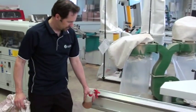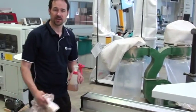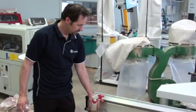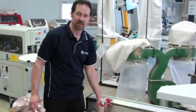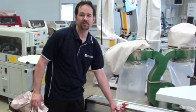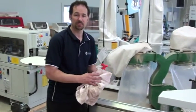On the types of saws which have the strips that are stuck on with glue, these products are not advised, because what happens is if the lubricant itself gets behind the steel track and into where the glue is on the back of the track, it will eventually eat away at the glue itself and you'll find the tracks can actually start peeling off the machine.